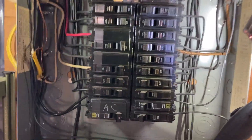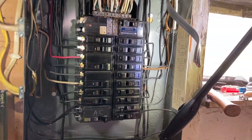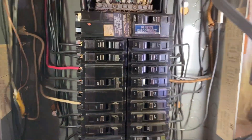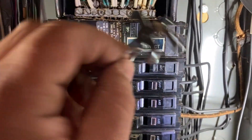We're just going to put the one piggyback in here. We're going to move the circuit down, then strip these wires and hook them into a 30 amp breaker right here in this spot. Then we'll put the interlock on, and that will make it so that only one — utility or generator — can flip on at a time.